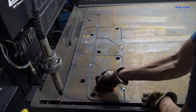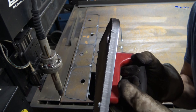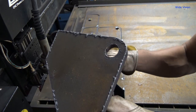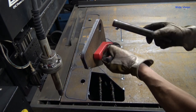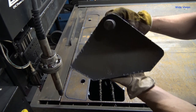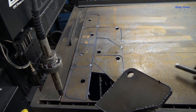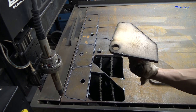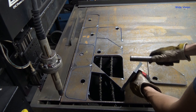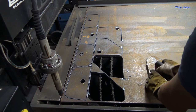Inspecting the results - nothing's even hung up, nice! That is a heck of an edge. Wow. Nice-looking hole. A little bit of taper to it, but there's a little bit of play in there - not much, but I need some play. You don't want to have a perfectly tight hole. It's a little bit slow because as you can see, I got some dross built up there - should have gone a little bit faster. But it's not going to take anything to knock that off. Nothing to complain about.